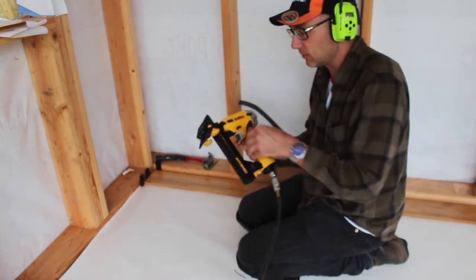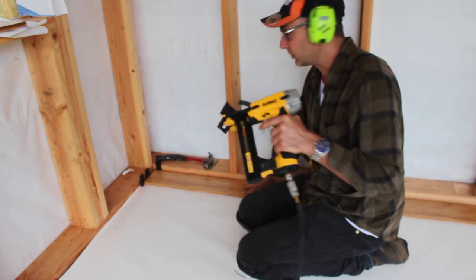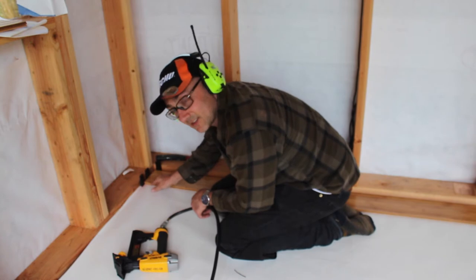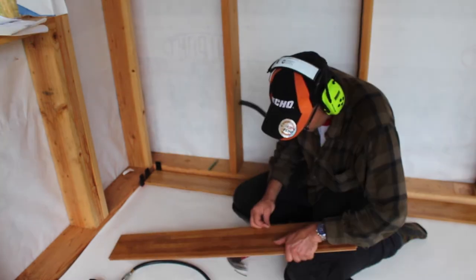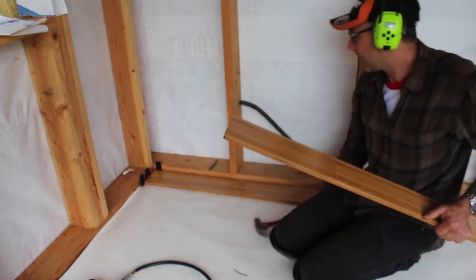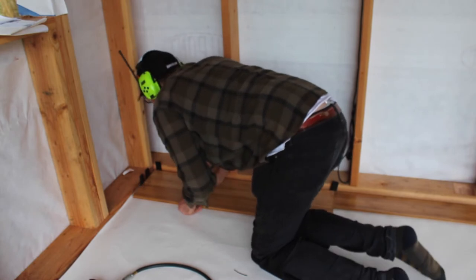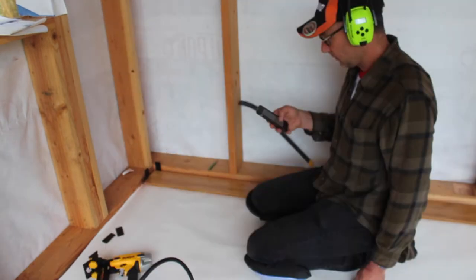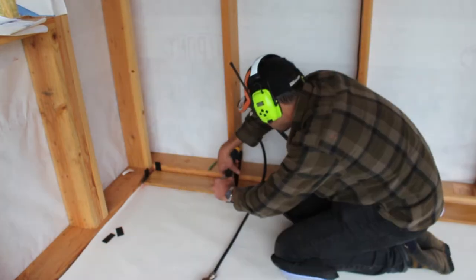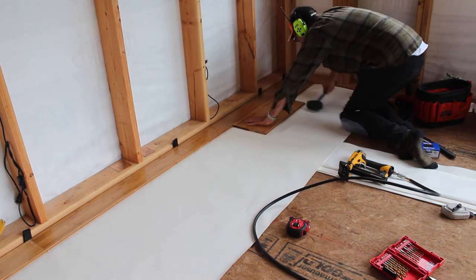I think I have this thing adjusted and calibrated for the dimensions of this flooring, and I'm about to shoot my first staple. That's exactly the way it should look. Let me back out this test staple — that seems like it goes in there just fine. Staple every eight inches. Staples were required instead of nails because the soft bamboo might get splintered if flooring cleats were used.